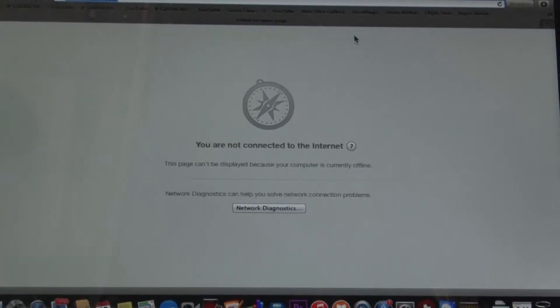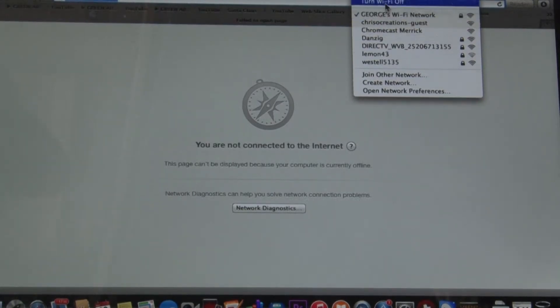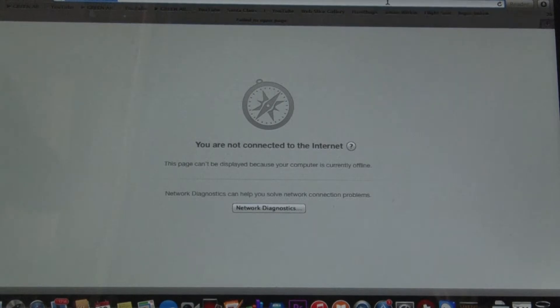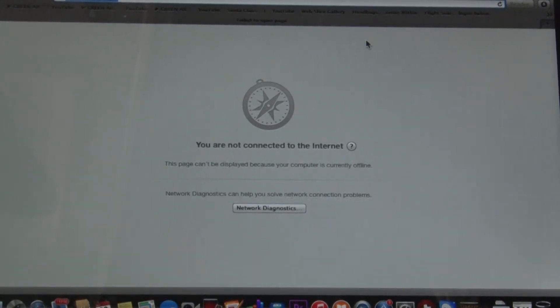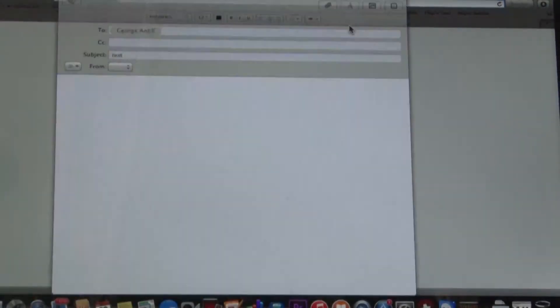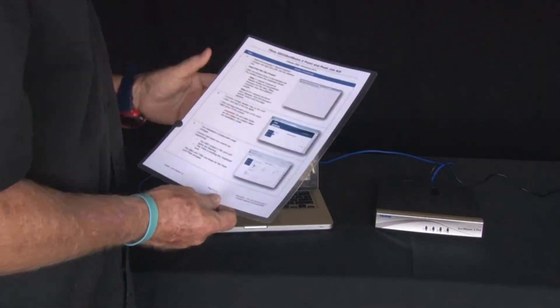You've also got to go to your Wi-Fi settings and turn off your Wi-Fi — you're creating your own network. Here's the page that tells you how to get into the modem. You want to go to Safari or whatever browser, go up in the top box, clear that, and type in 192.168.100.1/install. Most units, that'll work.